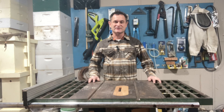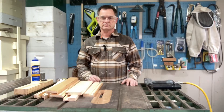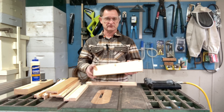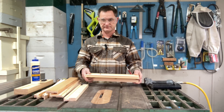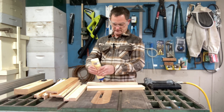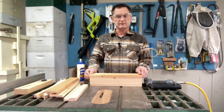Before we move on to assembling the slatted racks — now that we've cut all our pieces, the only thing left to do is assemble the slatted rack. We'll start with the front piece and the shelf. Remember that the dado in the shelf will face away from the front. We'll use Titebond II or any type of waterproof glue — I like to use Titebond II. Put a good amount in the dado, slide your shelf in lining it up with the edges, then turn it over and staple it.